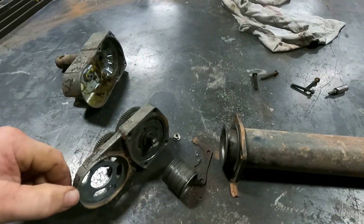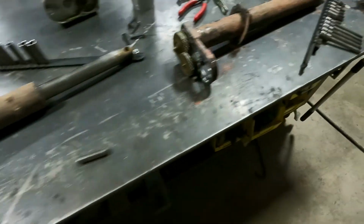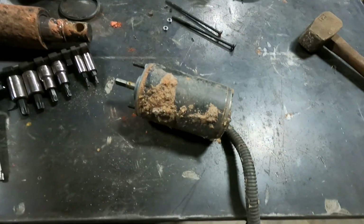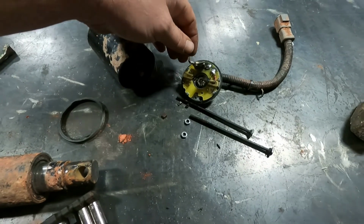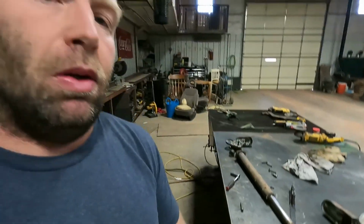All right, so on this one, the old actuator, I took it apart, and what was wrong with this one is the shaft was broke, and it wasn't pushing that ram in and out. So instead of taking this motor apart, pulling the backside off and putting it on this body, I'm just gonna put this on that ram and keep it together. And if it's weak or it quits, I'll put this one back together and put it on the shelf. And then I'm sure I can just order some brushes or something. Go to the starter alternator shop, try to match it up with something else. But I'll put it back together and see if it works. I'm gonna actually plug it into the machine and spin it, make sure it works before I go that far. But put it back together and we'll start it up after that.